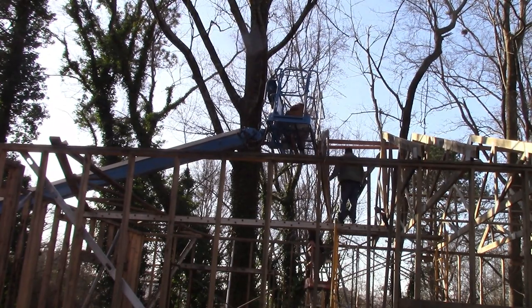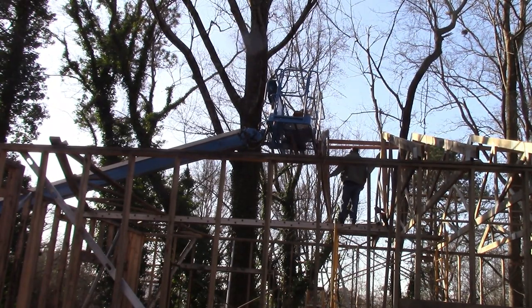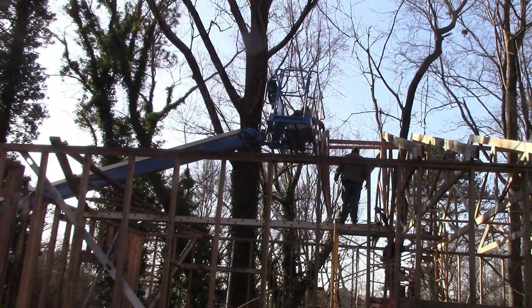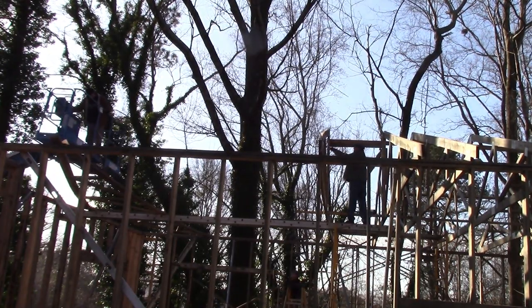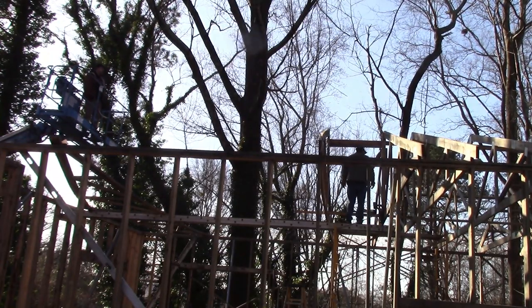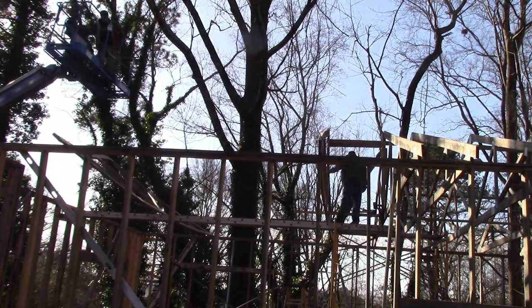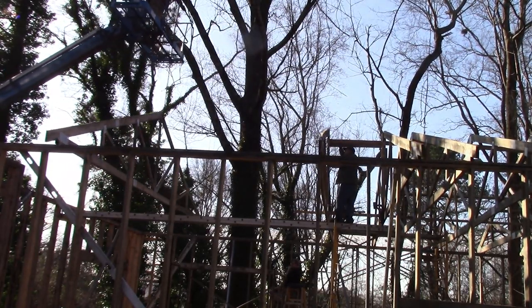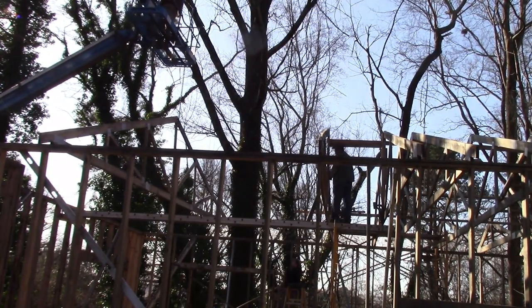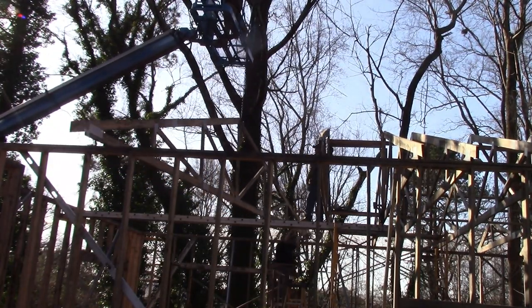What Connor is doing on the scissor lift is raising up on each side of the wall and setting the end of the truss on the wall. For now, we're just running a screw into each side on the wall to keep anything from moving back and forth and shifting. You'll see later in the video I actually take some of that loose, slide it down, and fix it. Our process for getting the trusses up on top of the shop is using a boom lift that we rented — Connor chains the truss to the boom lift, then I lift them up and drag them across the roof.